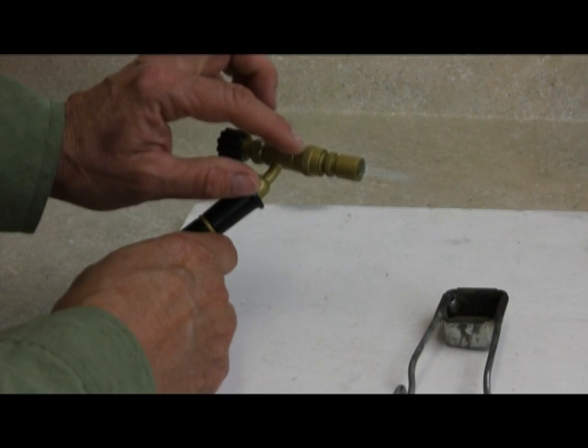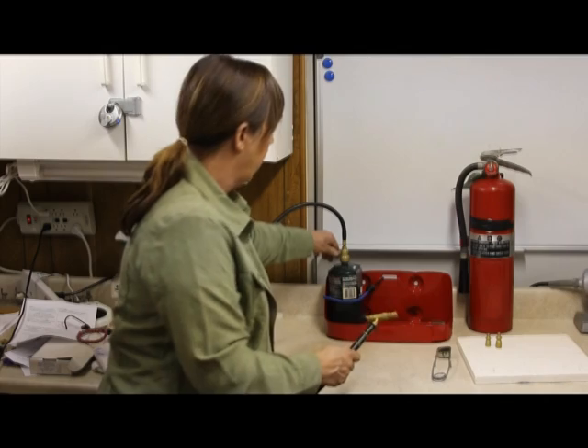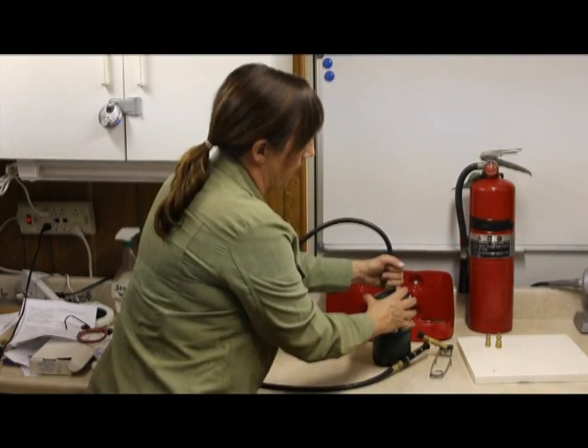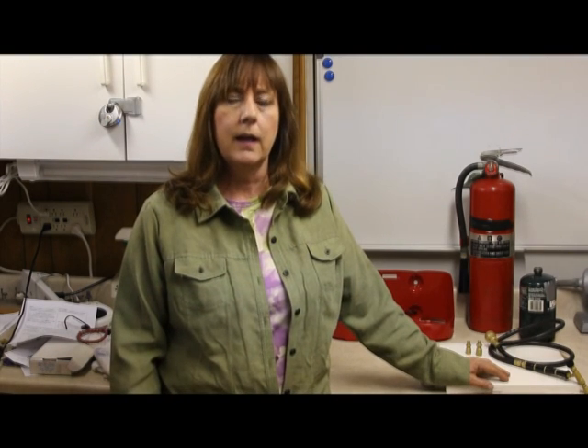To turn it off, all I need to do is turn this knob to reduce the oxygen and then turn the gas source knob off. Now I'm going to put the torch away. You never want to leave your torch connected to the gas overnight — it could be a fire hazard and you could have a leak you don't know about. With the torch and gas turned off at the can, I rotate the can away from me so it unscrews. You'll hear a small pop — that's okay. Well, I hope you enjoyed today's show on how to use the Easy Torch. It's a fabulous little torch you can take anywhere. See you next time!